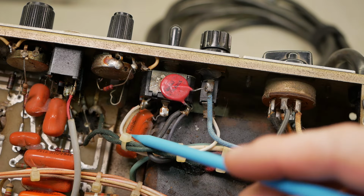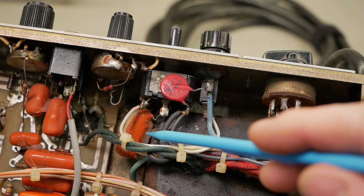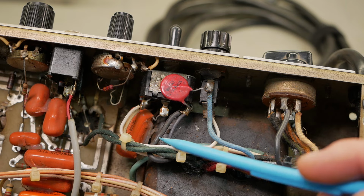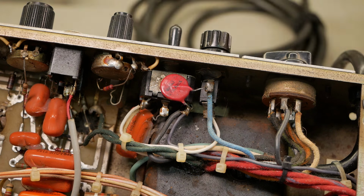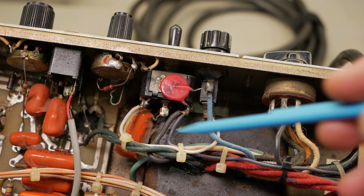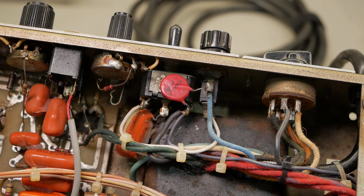So it's a capacitor that's placed between one of the mains lines and ground. Now, its job is from back in the day when you'd have your unpolarized two-pin plugs, like in the US. These days, I think one pin's bigger than the other, so it only goes in one way, even on the two-pin version. But back in the day, you could put the plug in either way, a 50-50 chance which way it went in the wall. So you plug your cord in one way, it was noisy, you turn it around the other way, it wasn't noisy, because the suppression cap was tied to one of the lines to ground, so it would shunt that noise to ground.